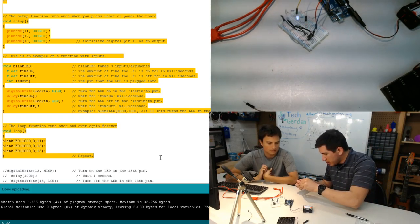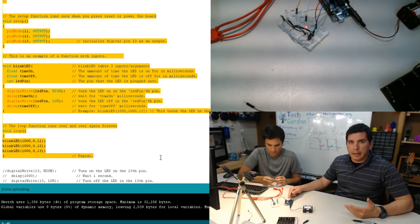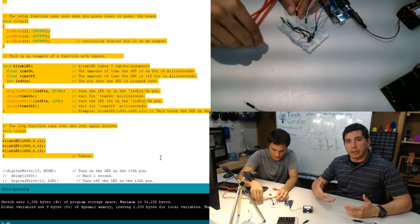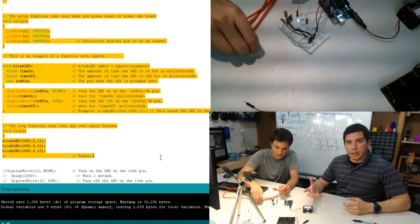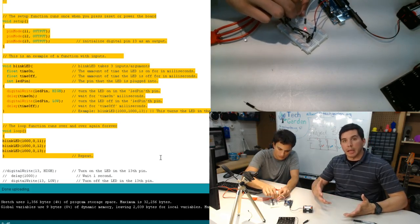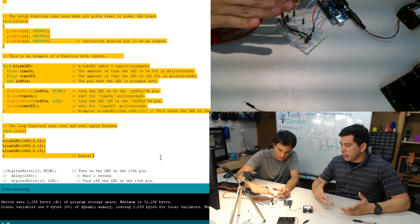There's a plus on it. So there is a little bit of a concern. We are providing a 5-volt output from these pins. However, the amount of current that the Arduino sources from each pin is fairly limited. In order to turn on an LED, it's not that bad because LEDs only require maybe tens of milliamps. But doing anything higher power than that becomes problematic.